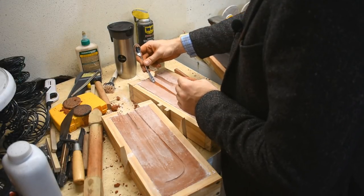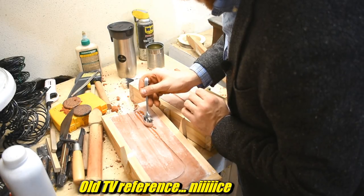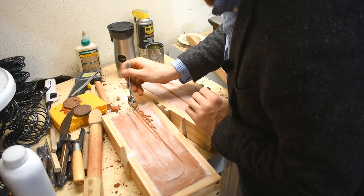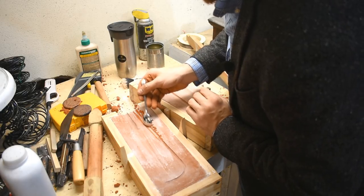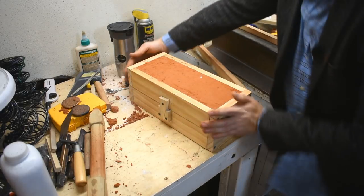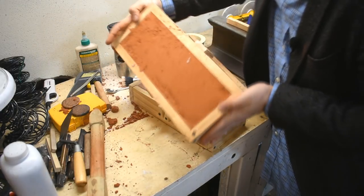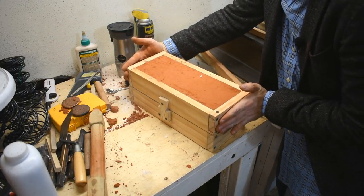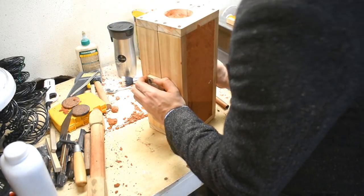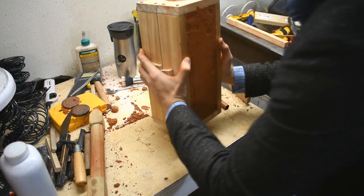Here I am embiggening the sprue — it's a cromulent word, look it up. I've been watching SW Dweeb, the other guy who did the aluminum bronze hammer thing, and he uses a big tapered sprue. I have sprue envy, so I'm going to make mine tapered. I kind of drop it to try to disturb any loose sand, which is why I was covering everything with baby powder — so if any loose sand did drop, it wouldn't stick and I could blow it away. Now for this vertical section — there's some loose sand, and now it's in my face. Excellent.